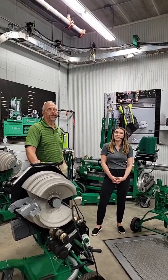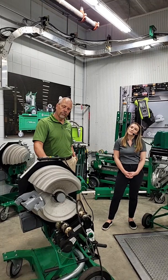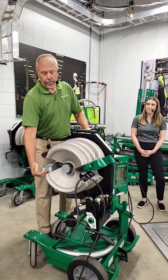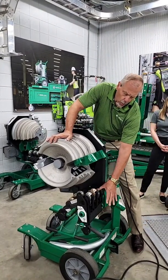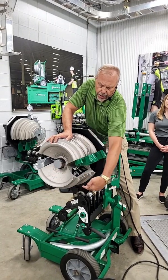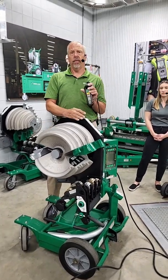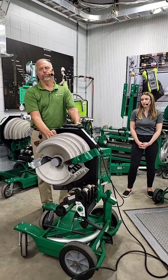If you're using an 855GX, can it automatically figure out spring back? Spring back is built right into the bender — that's why we call it our IntelliBender. The bender knows the position of the shoe for rigid, IMC, versus EMT. There are micro switches on the conduit holders on the back of the bender so it knows what size and type is being inserted. When you program the pendant, you just tell the bender the exact outcome you want — say 45 degrees — and it will accommodate for spring back.